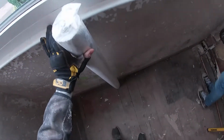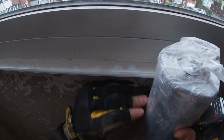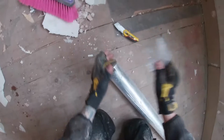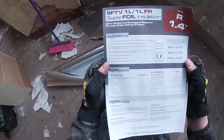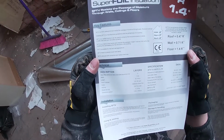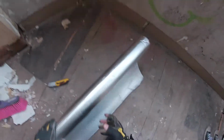So, lengthwise, the plan is I will start from the floor, and that bit I will leave hanging. That will go right underneath the parapet. Manual: it should be installed on the warm side of the insulated structure. Okay. So basically we're gonna overlap them a few inches. I think 2 inches will do, if needed.